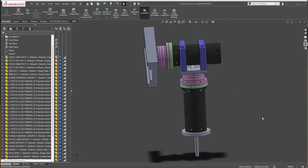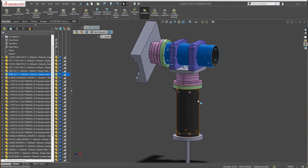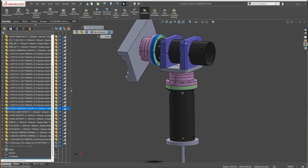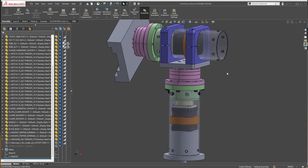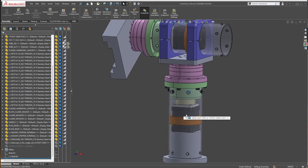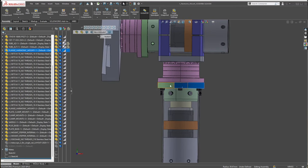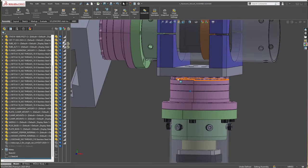Okay, here is my design in SolidWorks. This uses two carbon fiber tubes, some 3D printed parts, and some laser cut aluminum parts. If I change the transparency of the tubes, you can see inside we have NEMA 17 stepper motors with planetary gear drives, and then a 3D printed coupler. And sort of the key piece to this mount is these here.